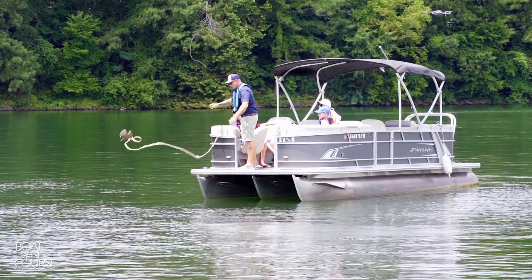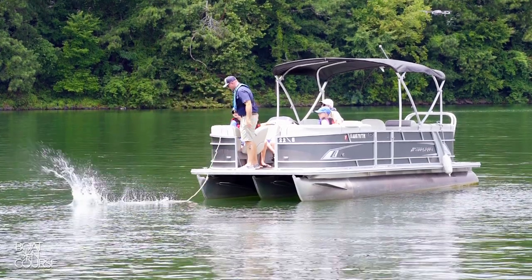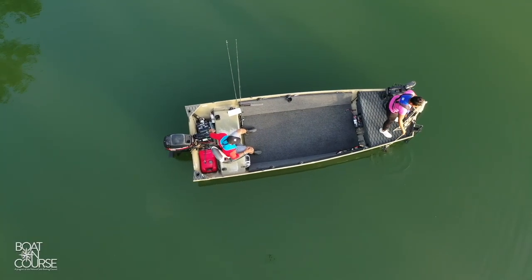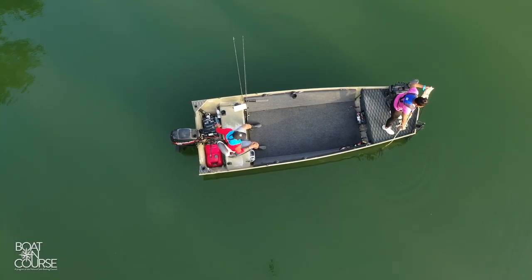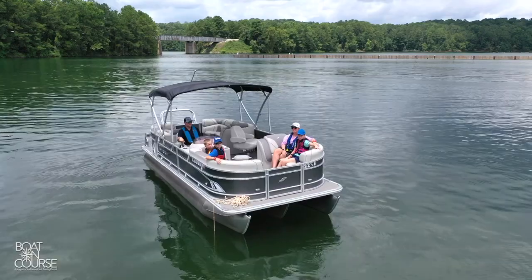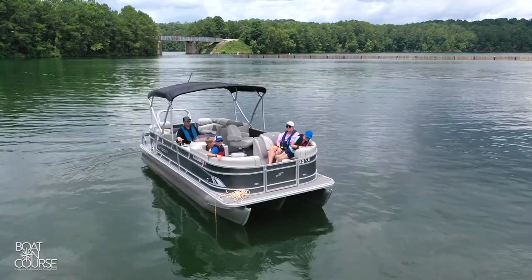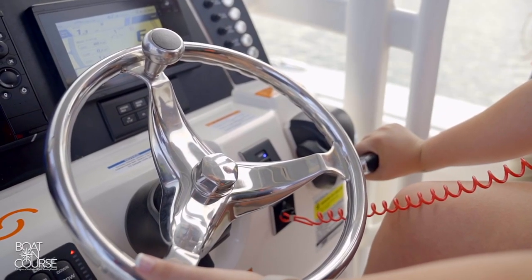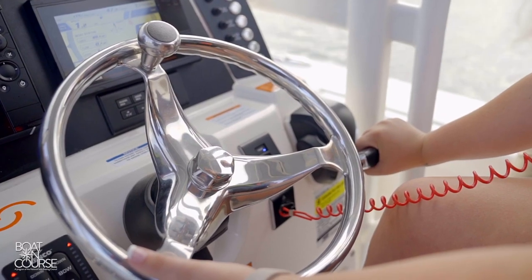Third, there is no need to throw the anchor — it is very heavy, and throwing an anchor can damage the side of your boat. Fourth, double-check that the coiled rope is away from your gear and your feet, and begin slowly letting the anchor line out. When there is wind and current, the boat will drift away from the anchor — use the anchor scope to set the anchor. If there is no wind or current, once the anchor is lying on the seafloor, put your boat into reverse idle and slowly stretch out the anchor line from the bow to set the anchor.